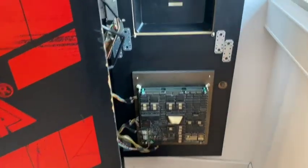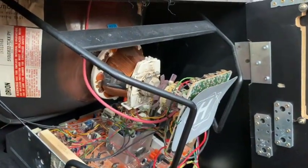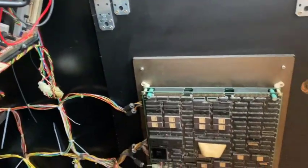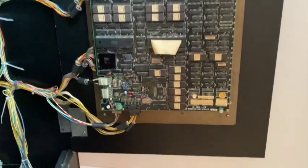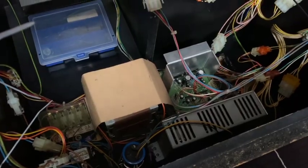In this case it's a Hantarex MTC 900E, and at first it didn't show any picture at all. It turned out to have problems with the B+ voltage circuit. It was basically a malfunctioning potentiometer. After I discovered that, I got picture back. I had some missing colors. It turned out to have cold solder joints on the RGB connector, which could be easily fixed.